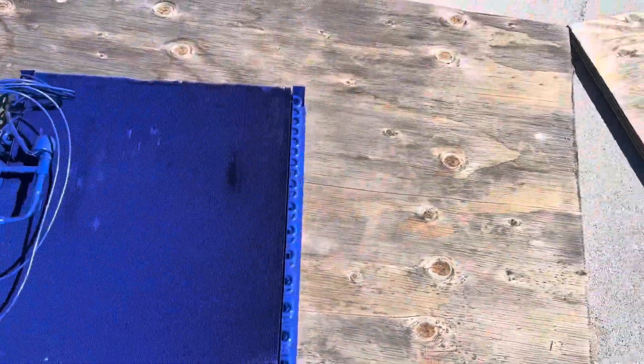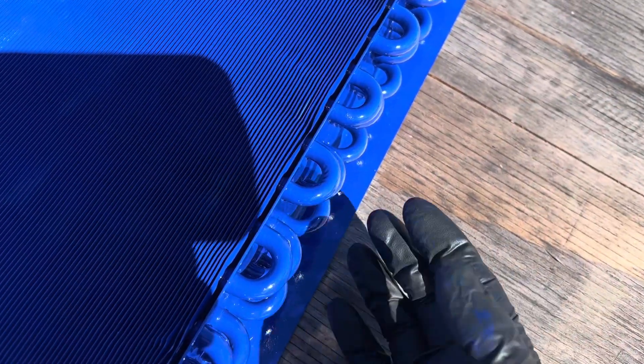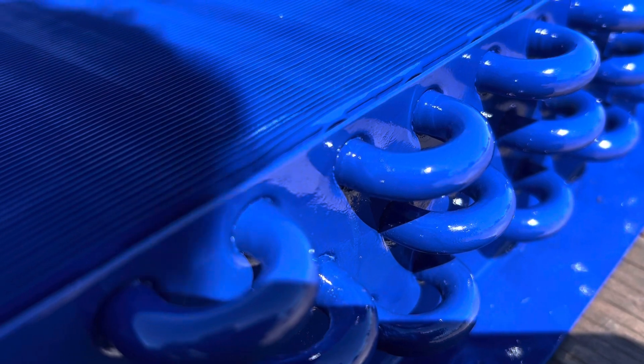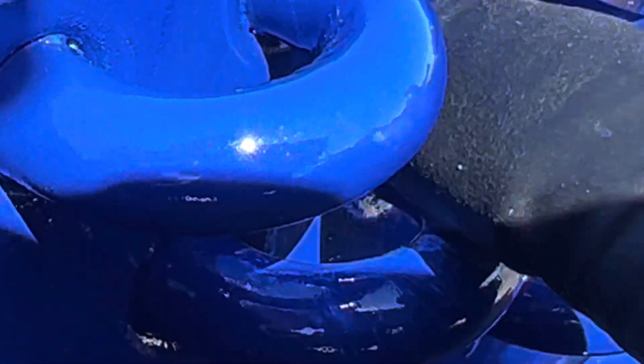Some chemicals are used inside facilities — even a housewife cleaning with Windex, which has ammonia in it. Chlorine compounds also attack copper. So you often see leaks forming right at the groove where the copper touches the header plate.